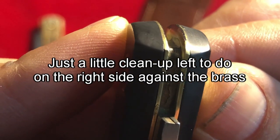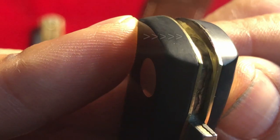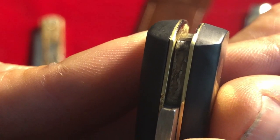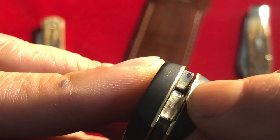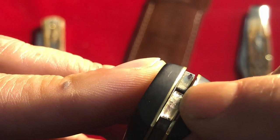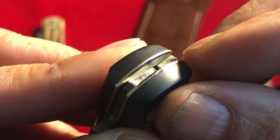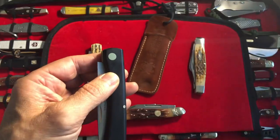And it was trial and error, no different than the blade centering, little by little, tiny, tiny little increments at a time. I had the cutting wheel turning in such a direction that it was not pushing any debris between the lock and the blade, because I didn't want any corruption going down there, so it was spitting it out that direction. And it's trial and error.